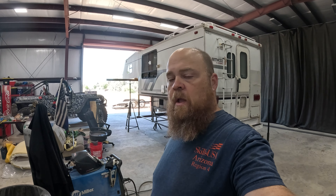I really kind of wanted to do this out of aluminum, but the cost difference is kind of surprising me. I knew aluminum was more expensive — if I was going to do this out of aluminum, it would have been more than $1,000 more than what I paid for this steel. So I'm going to go with steel on this. I'll probably end up TIG welding all this stuff just because it's fairly thin 16-gauge material, and I don't want to deal with blown holes through things. It also gives me an excuse to practice my TIG welding.